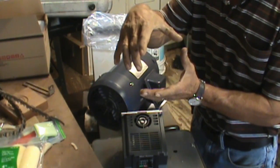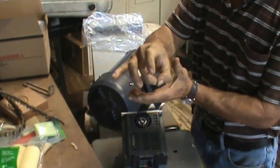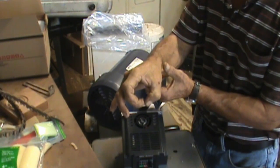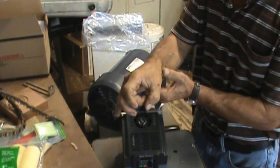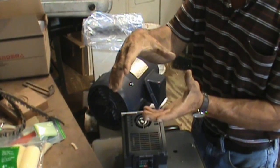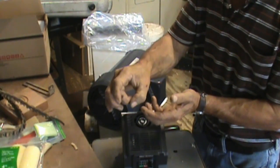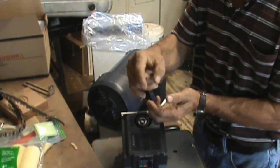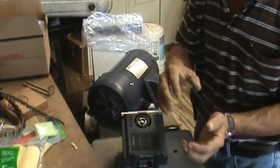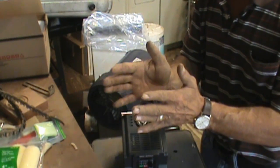The large pulley on your headstock is the low range speed. That means on the motor, you're on the smallest of the pulleys. Only if you can get something even smaller on a pulley, and we know you're not going to be able to change the one on the headstock, can you get higher torque than what you have right now. But probably not going to go that route. You're going to go with the standard of what you already have that's existing.